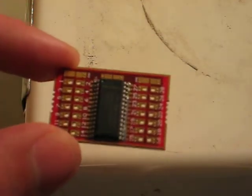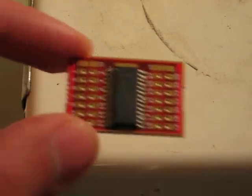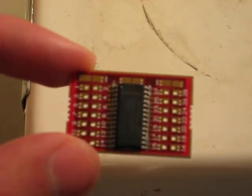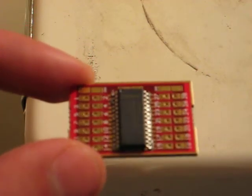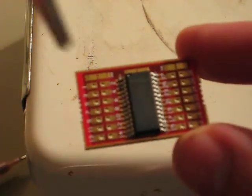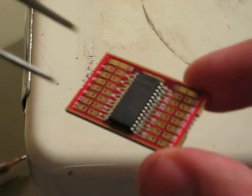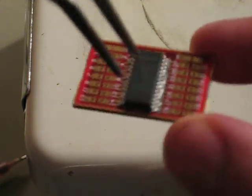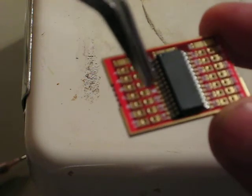Hey, Kenneth here, and I figured I'd just show you guys what I'm working on right now. I have a surface mount breakout board. This is from SOIC-28 out to 2 sets of .1 inch header. What I've got on it right now is a Max 6921 chip. I haven't soldered it on yet, but I've just put all the solder paste in two nice beads and then dropped the chip right on top of it.